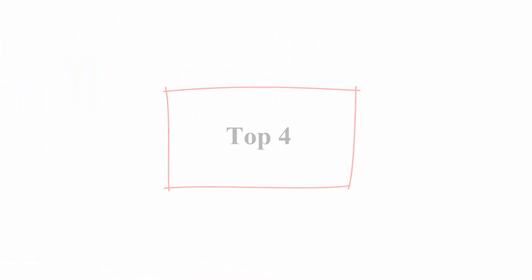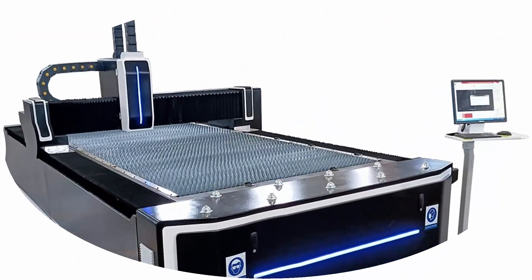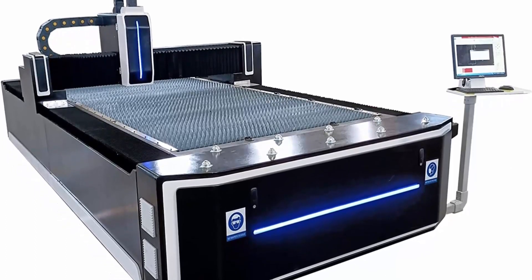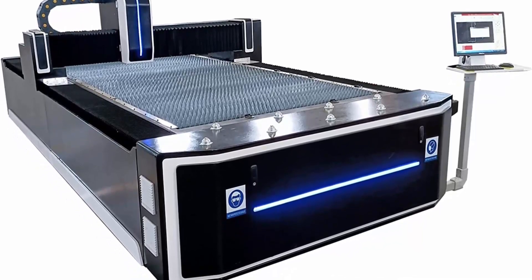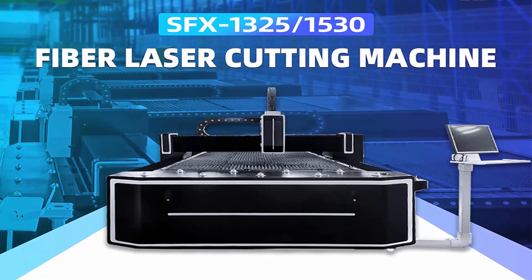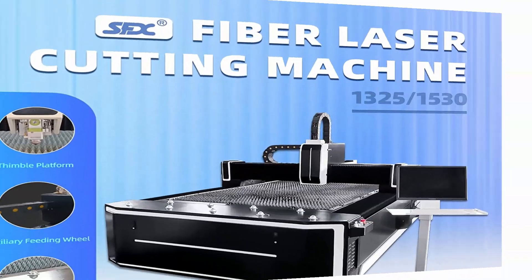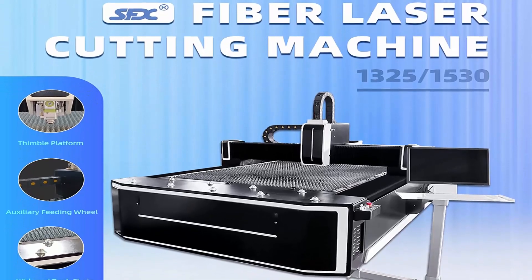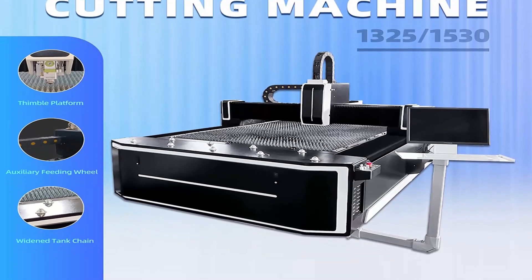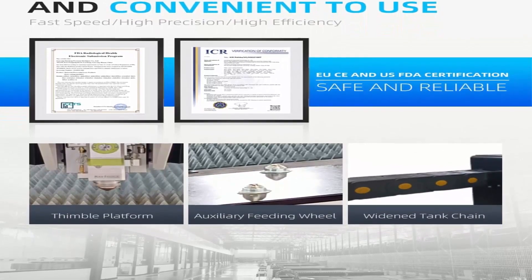Top 4: 1325 Fiber Laser Cutting Machine with Max Laser Source 2000W, Metal Laser Cutter. Working area 1300×2500mm (51.2×98.4 inches) for 5–18mm carbon steel, stainless steel, aluminum, brass, and more. Laser wavelength 1080nm, beam quality 0.373 mrad. Cutting accuracy ±0.05mm, repositioning accuracy ±0.03mm. Max acceleration 1.2G, max cutting speed 60m per minute. Assist gas options: Air, Oxygen, or Nitrogen. Cooling method: Industrial Circulation Water Chiller. Aiming and positioning via red dot.